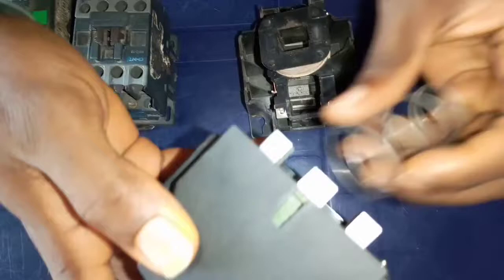So it will magnetize this metal, meaning that it will magnetize it like this, which means that it will switch automatically. And the work of this spring is to enable it to go back to the origin — that is, go back immediately when there is no supply to the coil.